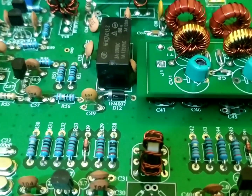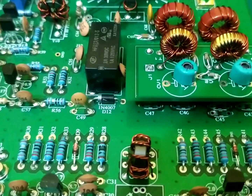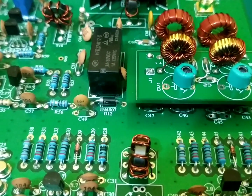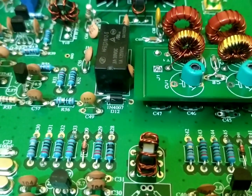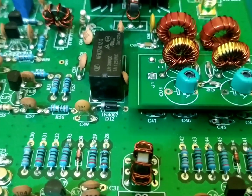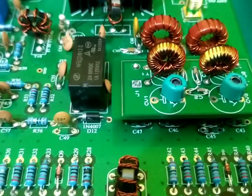With the new band pass filter PCB, you can get better RF output and receiving performance. It is much more simple to build than with the IF cores supplied earlier. People were having issues trying to wind the IF core, which was not a pleasant experience, but this toroid approach is a very simple method with no issues winding turns.